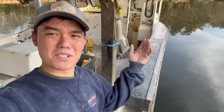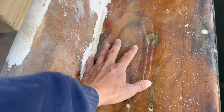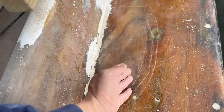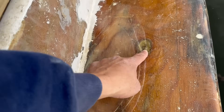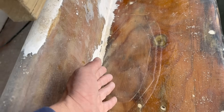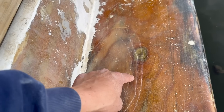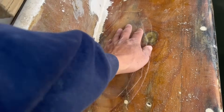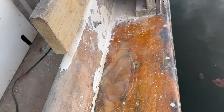I don't know what I was thinking, but as you can see I went through all the trouble of cutting different size pieces of fiberglass and then promptly laid them all in in the complete opposite order they're supposed to be. I started with the biggest piece and went to the second biggest and then the third, when you're supposed to start with the smallest piece and work up to the largest. I think it'll play though — we'll sand her down, put some paint on her, and you won't even notice.